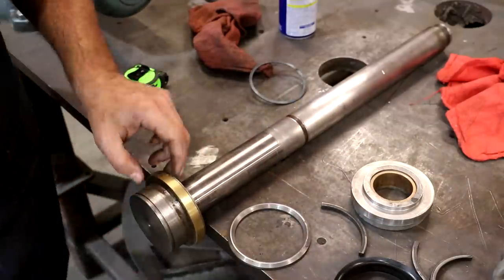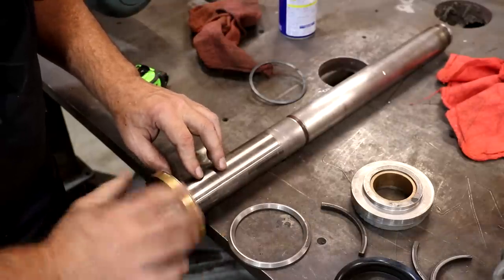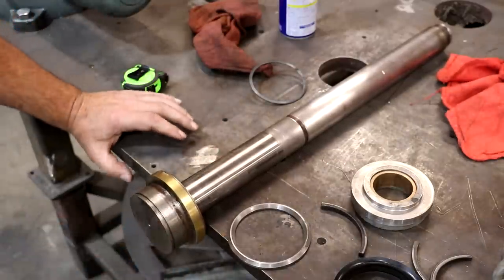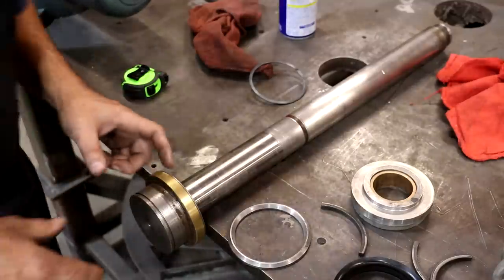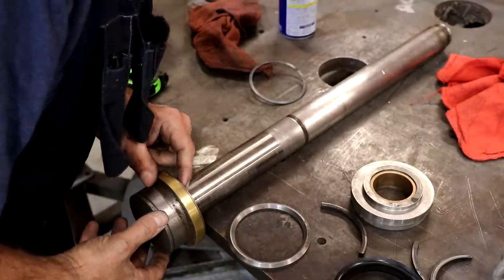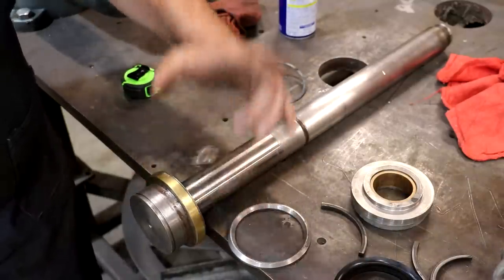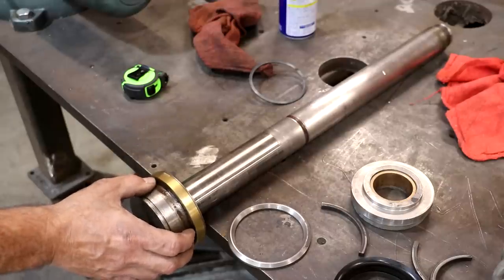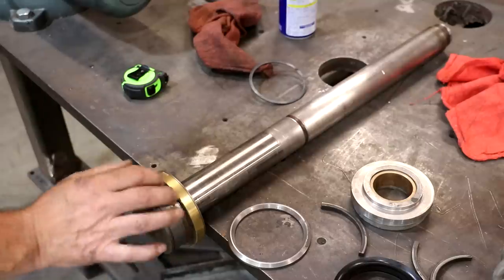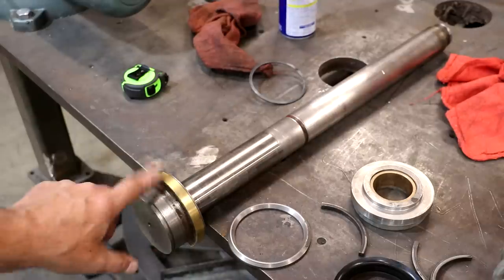Above that we've got the brass ring on here — this is just a little piece of brass, turned and pressed on there. I'm going to replace this. I've got a piece of brass we can put on there. But before I do, I want to get some good measurements. It's a four inch diameter bore, and the top of the piston is stamped 3.995. A hydraulic rebuild expert told me this brass needs to be about five thousandths smaller than the bore. I need to try to mic the bore on the cylinder just to make sure it is still four inches and hasn't enlarged over time, but I'm pretty sure it'll still be real close to four inches.